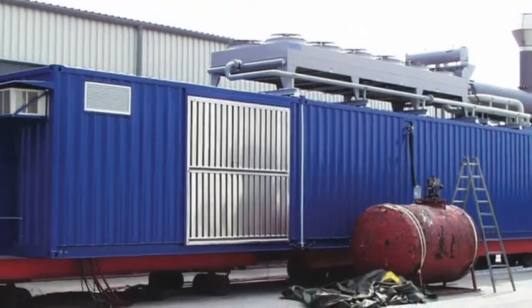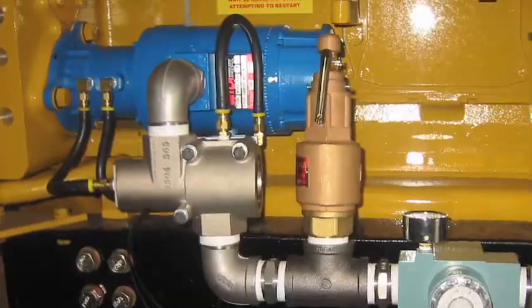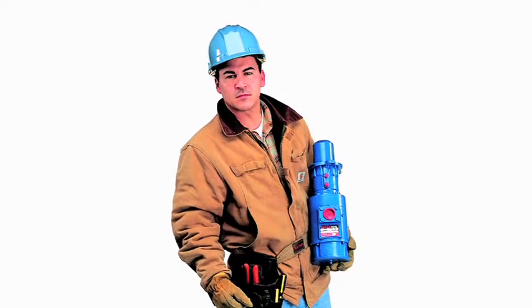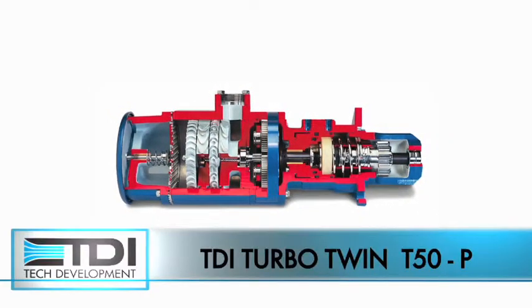And when they have to change them, they're so doggone heavy, with all the piping and tubing for the pre-lubes. We went up and switched them from the vane to the little T50P starter — it weighs 34 pounds, it's way easier to work on, and it's a great little starter. They're ecstatic about it. We did one on a trial and now we're going to do the other 17 within the next year.